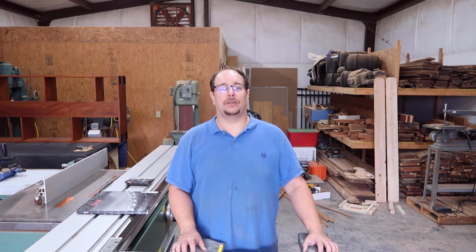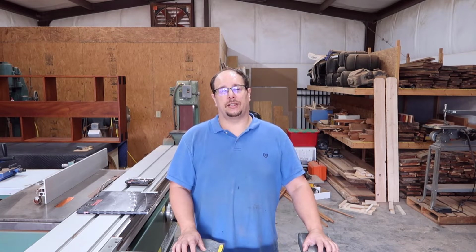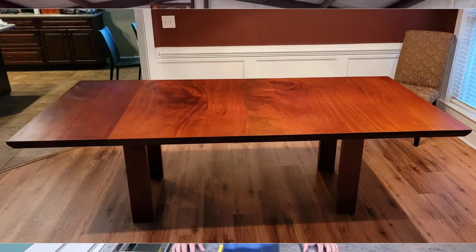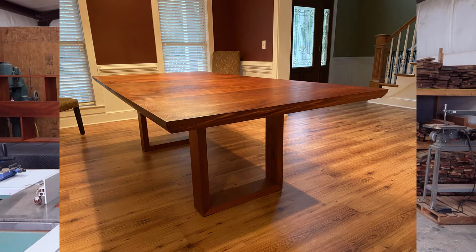That's because I was looking for dining table sets and I couldn't find what I wanted. So I said, let me start building stuff, and when I get proficient enough, then I'll make what I want. And I made what I wanted. It is 4 feet wide by 8 feet long and about 30 inches tall. 2-inch thick tabletop split in 2 halves, 4 by 4 for each.